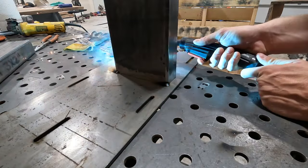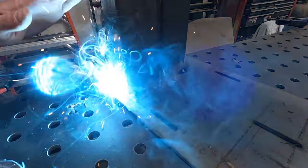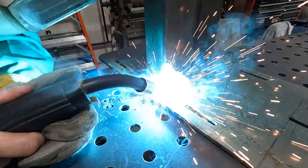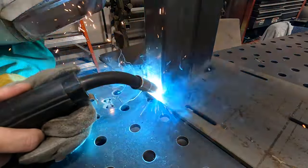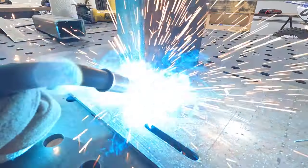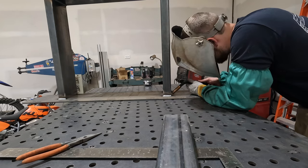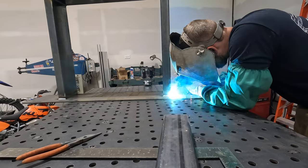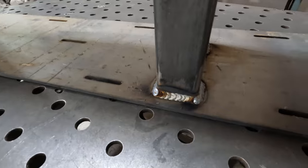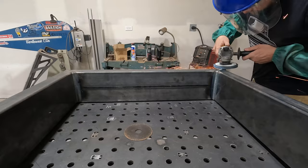Use lots of tack welds — it just keeps everything where it's supposed to be. You see me here just stitch welding these; you don't have to fully weld this out. A lot of people make that mistake. If you were to weld this out completely, you're just adding a bunch of heat that's not necessary and it's going to cause it to warp. And if your mounting plate isn't flat or straight, over time you're going to put that torque on the wood after it's bolted up, and the wood's going to try to follow that — eventually your wood might start cupping.